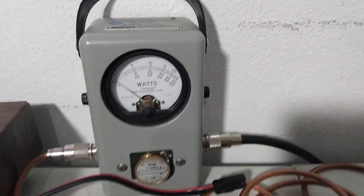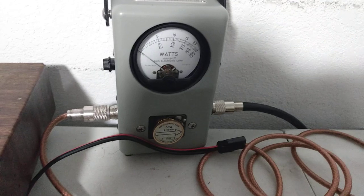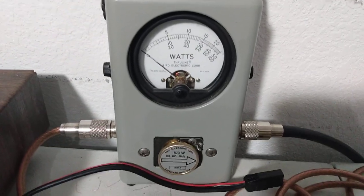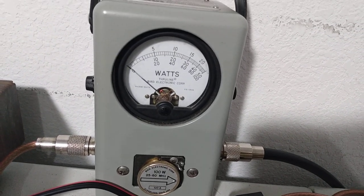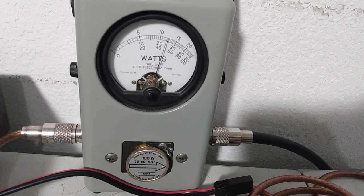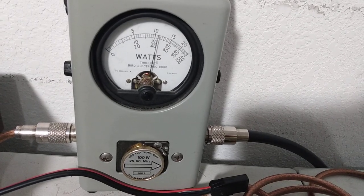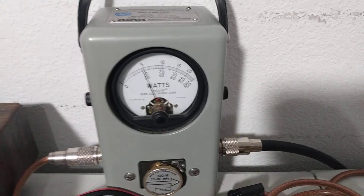I'm going to put my 100-watt slug in there and see what it shows. Just had to grab the 100-watt — I usually keep it handy but had it in the slug case. So we've got the 100 in there now. We were reading 50 watts on the middle scale; now we're looking at the bottom scale, 100 watts. Just talking into it — around 45 watts. You hit it with audio, still doing about 50 PEP.